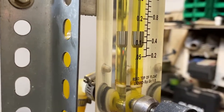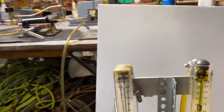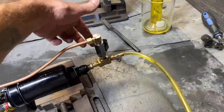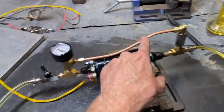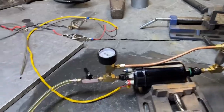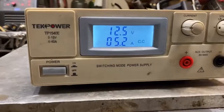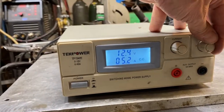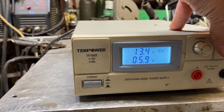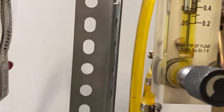This is making for a boring video at this point but you get the point — the damn thing can be set wherever you want it, just by touching this valve. In the event you've got some serious back pressure, you would simply drop this bypass valve back and close it a little bit, and that causes a static pressure loop that's continually cycling through the pump. This is our flow valve; this is the bypass valve. We're at zero pressure, about 12.5 volts constant current. You're more likely going to be running in this area if you're connected to an alternator.